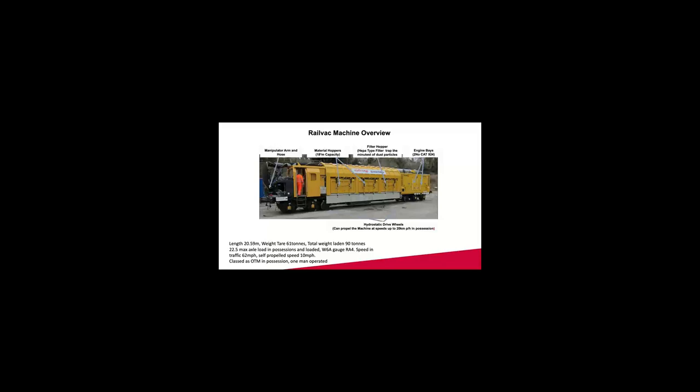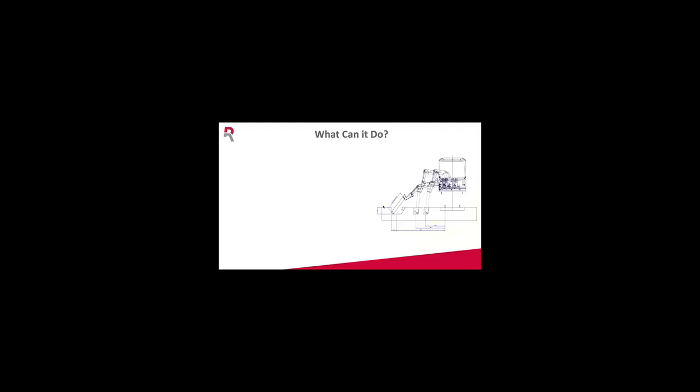Within the possession, a Railvac becomes an OTM machine. So you haul a Railvac into site as a regular wagon, and then the operator sets it up as an OTM machine within the possession. For discharging material on-site, off-site, we have deflector plates that push the material out of the site. And here we have the range of the machine, the standard range, as a nozzle from the rail.